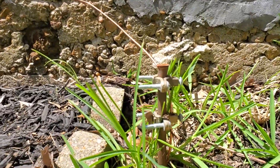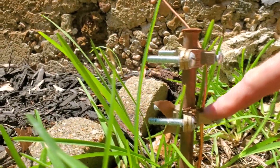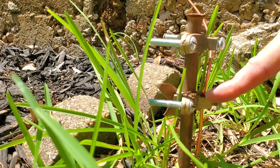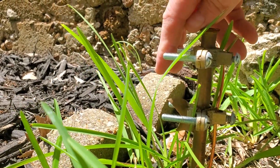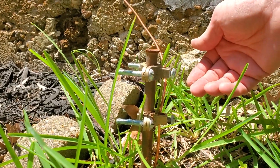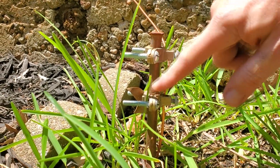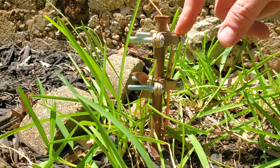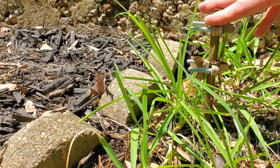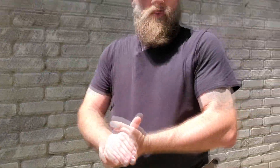Because we know that solder connections are the worst connections to have, I made these all mechanical. The mechanical connection is here — the wire comes into this bottom one. I know some of you are probably going to be saying, why don't I have any lightning arresters? Well, I'm still shopping around for them, trying to see which one's the best bang for the buck. I'll have those attached eventually with my antenna wires attached to those, then run more patch cables back up to the panel. But for right now this is a decent little setup. I do have an 8-foot ground rod that I had to drive into the ground here, and I got a couple mechanical connectors to set it all up. I have room for more stuff down the road — I can also put another ground rod in if I need to.